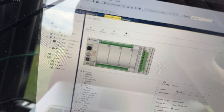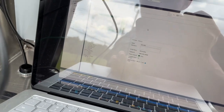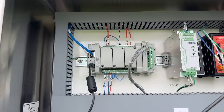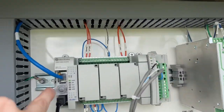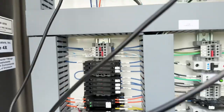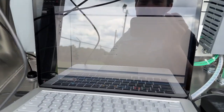You can see a visual representation of the controller I'm working with. Now it should be building everything, calculating all my inputs, and it's going to download to the controller. Hopefully if everything goes well I won't have any faults. We need to download the current project to the controller - if you try to upload instead, you'll take whatever program is already in here and upload it to your computer, erasing everything you've been working on, so don't do that.